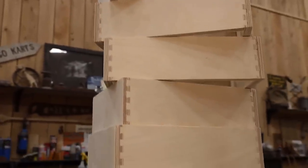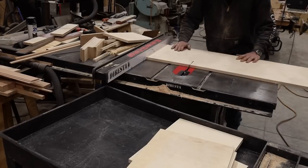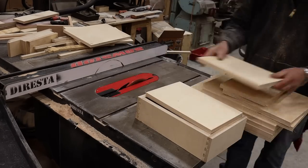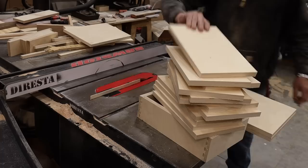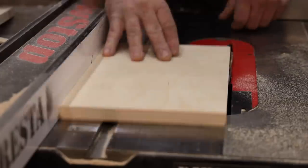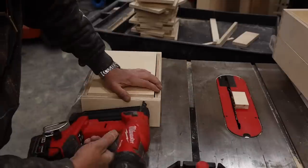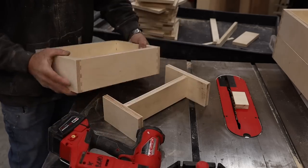Now here are all my boxes — I did have to go back and fill a couple of little spots, but honestly not a lot. Then I have to make the bottoms. I do a curious thing with the bottom: I inset it just a little bit, then put a bevel on — half of three-quarters is three-eighths — so three-eighths is nailed into the box and three-eighths gets this bevel on it. That way it can puzzle into the top of the open box below, making nesting boxes. It's just a butt joint — not the most elaborate joint — and with my little jig I'm able to throw some nails. I left the glue out and just put a lot of nails.